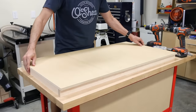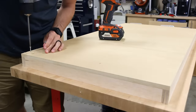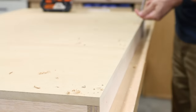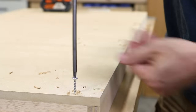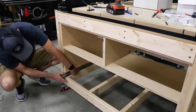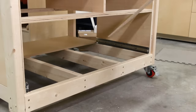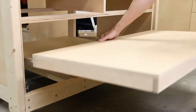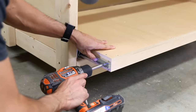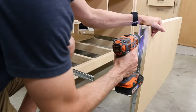I attached the freshly cut tray top to the frame with one and a quarter inch screws, countersunk and evenly spaced throughout — and yes, I spent 10 minutes laying those out. I'm using an Accuride 3607 drawer slide for that bottom tray. It's got a cool feature that allows the tray to lock in the out position. It installs like any other drawer slide and I attached it to the side with the mounting screws. Then I used a quarter inch piece of ply as a spacer, put the tray in place, secured it to the slides, and made the final connection.